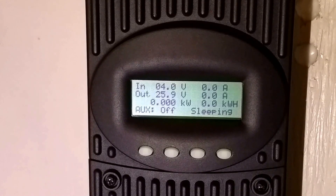The fast integration is how the FlexMax integrates its PV operation voltage — the default is fast. It's used for Outback systems and other modern inverters. That's how you set fast and slow integration on the Outback FlexMax 60 and 80.